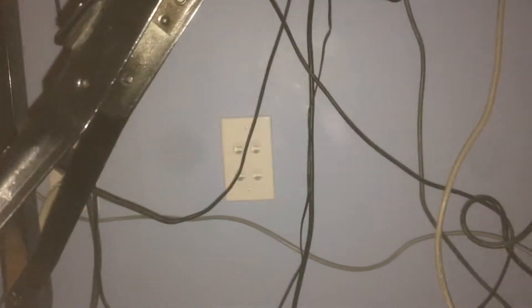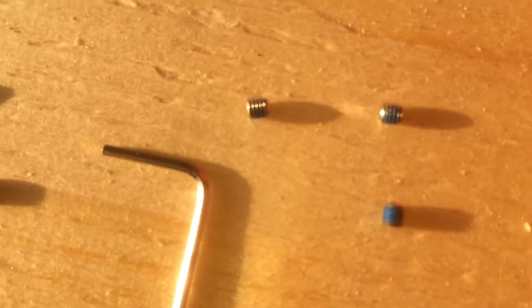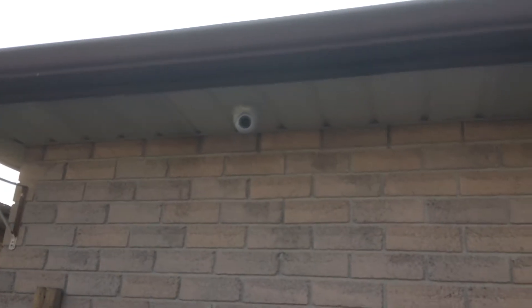I made up three six-foot cables to go from this wall plate to the NVR. If you're installing cameras with wires exposed outside, this package comes with wire-tight connectors, so you would have to put this on before you put your RJ45 on. The package also comes with tiny set screws — after you adjust your camera angle you want to put these set screws in and tighten them.